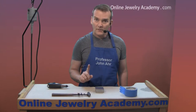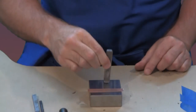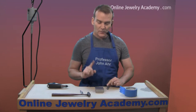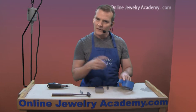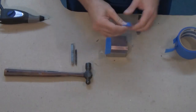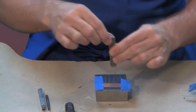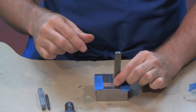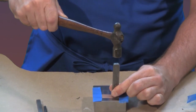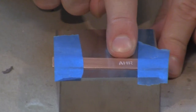The way that you properly use a stamp is you want to make sure that it is flush or flat to the hitting surface. Before you begin, if you're working on a piece of stock that you're going to turn into a ring or a wedding band, you may want to tape it to your bench block so it won't wiggle or move and you don't hit your fingers. I'm going to put this right on the piece of copper I have here, hold it near the end, then take a work hammer and strike it once. That should be enough to leave a good mark — and sure enough, there's my name.